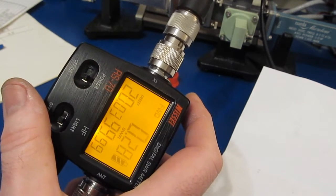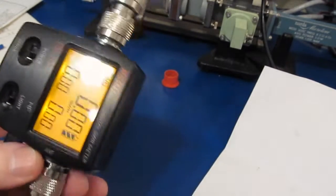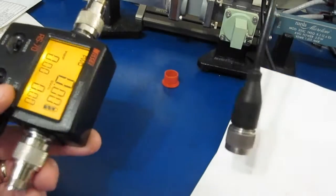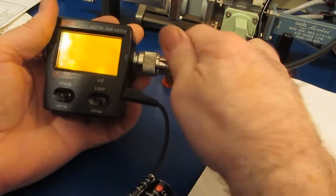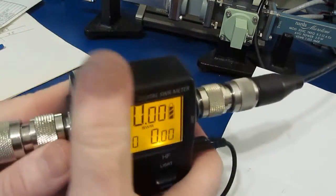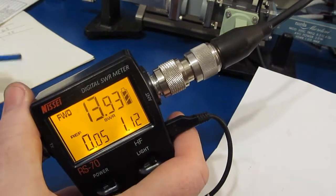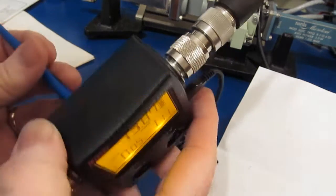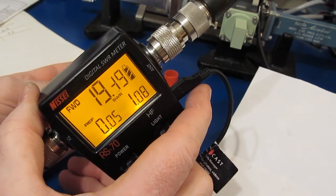Alright, one more time. We'll turn the power back off. And we'll flip our two connectors around. Put the diddle stick on the right pot this time, hopefully. Alright, and we'll turn her back on. Of course, we got 14 watts now. Imagine that. Forward power pot. Again, we'll this time get around the forward power pot. Oop, wrong direction. And again, we'll set this back to 20 watts.